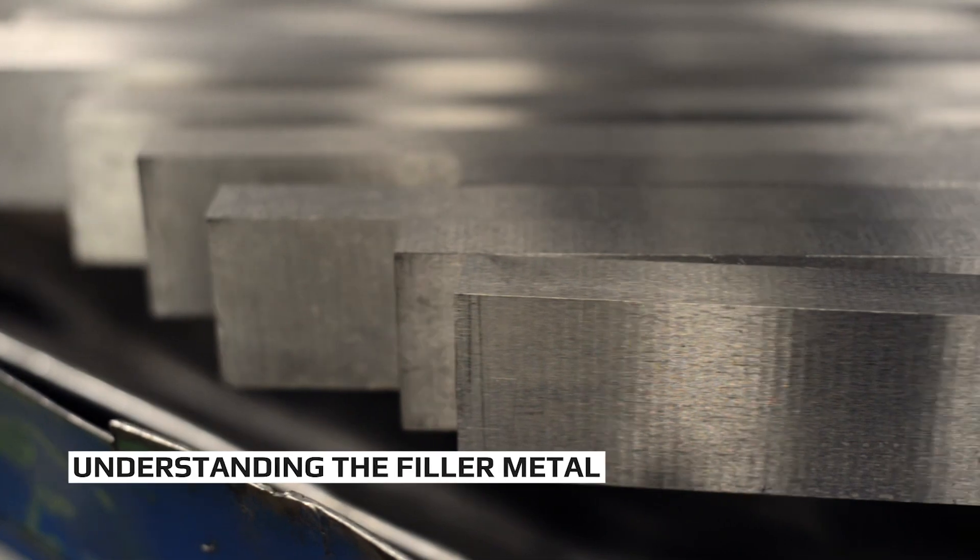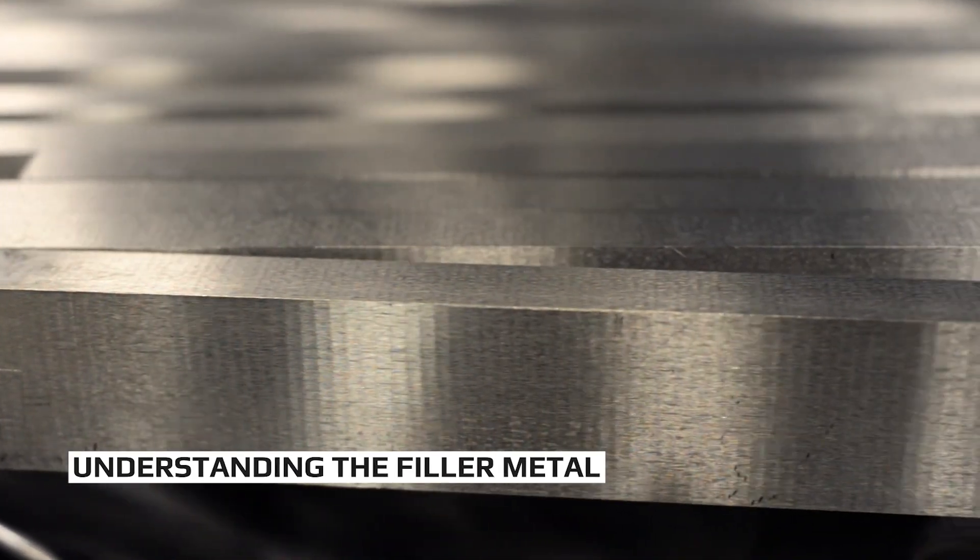If you're welding on A106 grade carbon steel, you've got to have a filler metal that's compatible. The way you know you're using the right filler metal is to go to your QC and make sure the weld procedure specifies the right wire. I always double-check with the procedure and the QC, and I check every individual piece of wire. I've seen welders who don't check their base metal end up welding an entire weld with the wrong wire — and it has to be a cutout. So checking your wire for compatibility with the base metal is a huge deal.